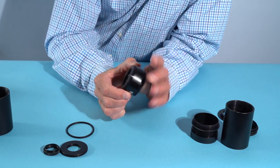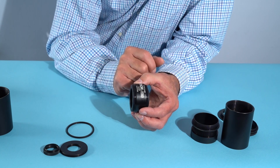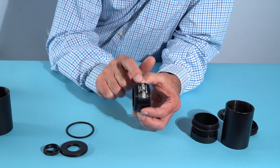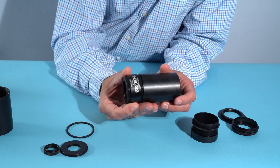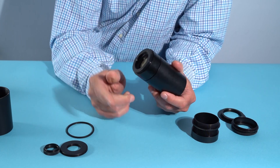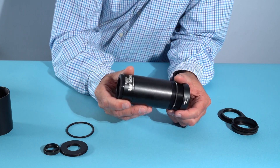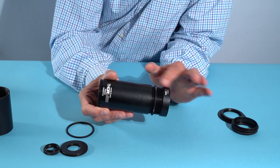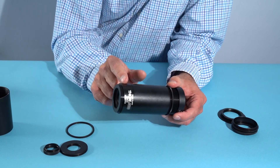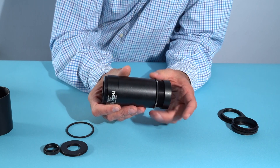This is a Nikon tube lens available from Edmund Optics, and it screws right into this Thor Labs tube lens adapter. Be careful because it only goes in one way — this side of the lens goes to your objective and this side goes to your image plane where your sensor is. We start assembling from the camera side first because we have to adjust the tube length to match this 200mm optic. This adjustable screw mount allows about 20 millimeters of travel so I can change the focal point of this lens to my sensor. It comes with a locking ring to lock it down once set.